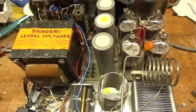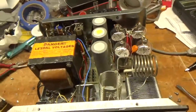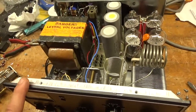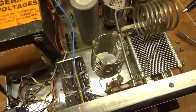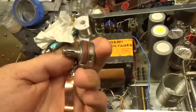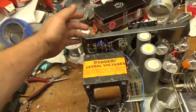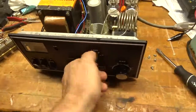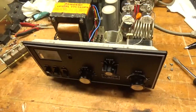Went through the rest of it — everything looks good. So what I did was I took my analyzer and back-fed it. Figured out the loaded plate voltage and the max plate current. Took the max plate current, multiplied it by 1.7, then divided that into the loaded plate voltage, and then I took a rheostat — carbon type — and went from the anode to ground. Then I hooked my analyzer up through the output connector, keyed the TR relay manually with everything else off and unplugged, put it on the proper band, and tuned the output network plate load and topped it properly so I got a good match.